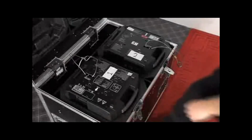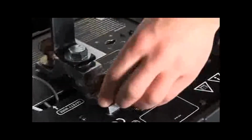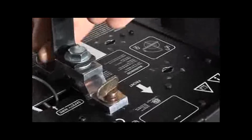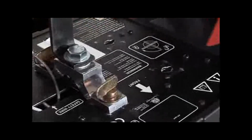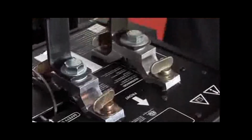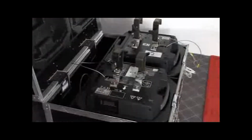Moving head fixtures being hung will require clamps to be attached to their base before they can be put on the truss. These clamps are attached with swivel locks. There are holes on the base of the movers where these clamps can be attached. Place the clamp over the holes with the opening of the clamp facing the same direction as the front arrow. Insert the swivel lock by turning the blade clockwise.